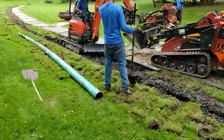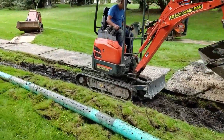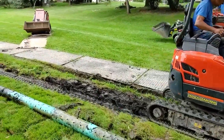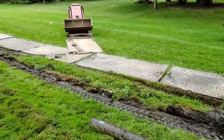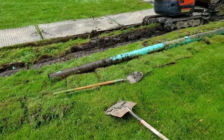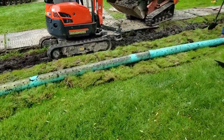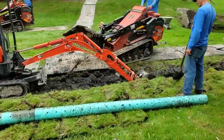They know the truth behind PVC pipe with only holes on the bottom that point down. You don't have holes 360 degrees, so you can't take water in. Once there's sediment on the bottom of this pipe, you're done. And if you don't use a really good non-woven geotextile filter fabric, the sediment's going to find this pipe that much quicker — and it's done. All right everybody, until the next video.